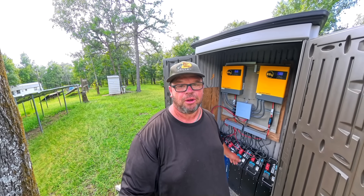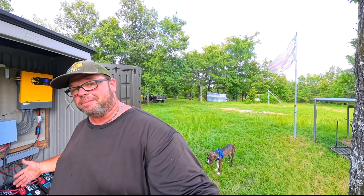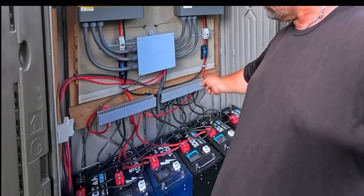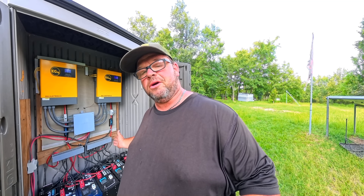What a great system. I love not having to worry about power — I feel like I'm doing just as good as anyone connected to the grid. The only thing is I can't add any more batteries because there's no more room and the bus bars are just about filled up. These bus bars are rated for 600 amps and you can pull 100 amps out of each battery if needed, so six batteries pretty much maxes out the bus bars.